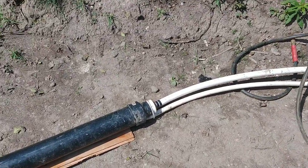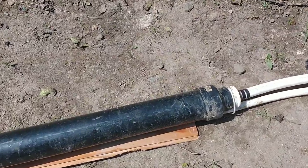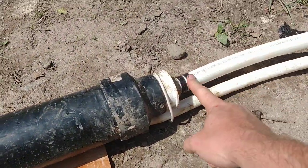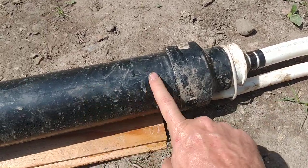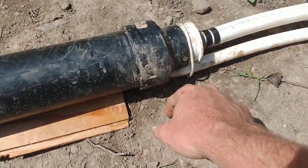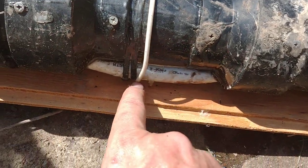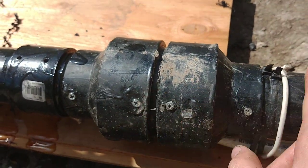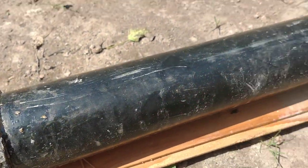Here's the pump that I designed. It's three inch ABS, but with the cuff at the top it's more like three and a half. The one inch PEX goes in here and this chamber gets pressurized. This is the three quarter feeding tube for the air hose. The air hose comes down through this pressurized chamber and then is released inside here, and it bubbles up and pressurizes this chamber.